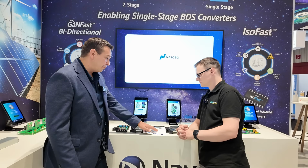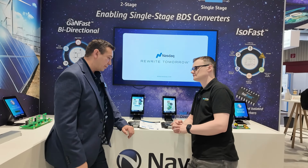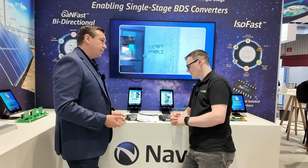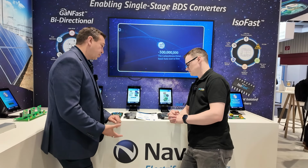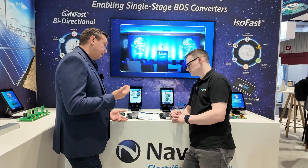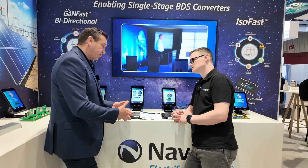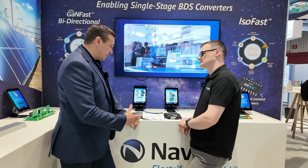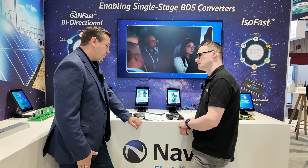And with this one, for example, the magic in the bidirectional switch is the active substrate clamp. When you're switching between the different states, you need to pull down the lowest source node to the substrate, because that reduces any drift of RDS(on). This is a very difficult challenge. It's monolithically integrated on the GaN chip. Because we're an IC company, we figured this out first, and we have the best reliability and best performance.